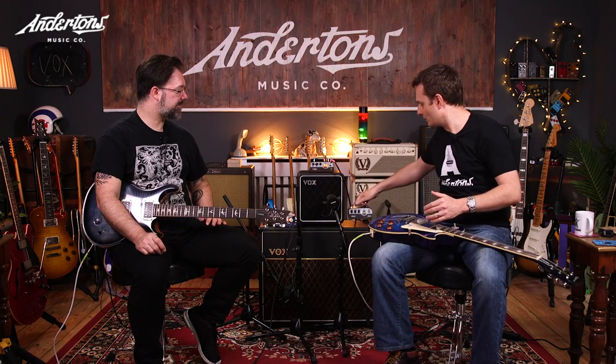So look, we have talked plenty. That's what's basically inside this. The power amp, the 50 watt power amplifier, is a Class D power amplifier that's very widely used in audio equipment. Lots of guitar amps have that type of power section. So it's just in the preamp that the tube works. On the back, this might be easier for us to flash up a picture of on screen now rather than a close up, but we'll see.